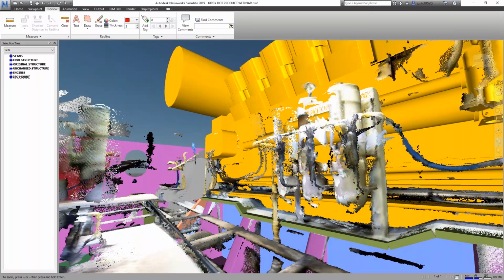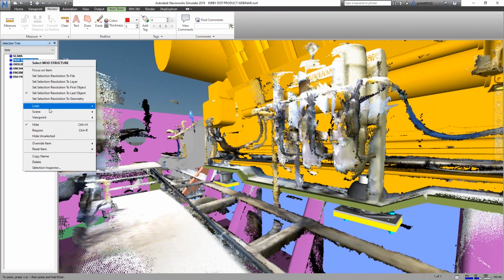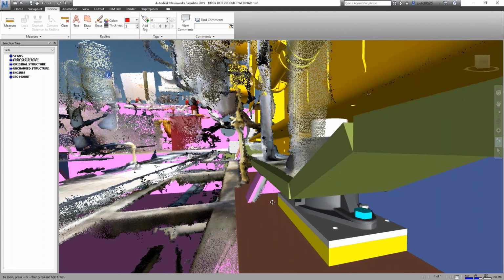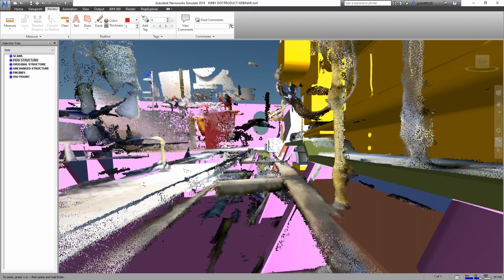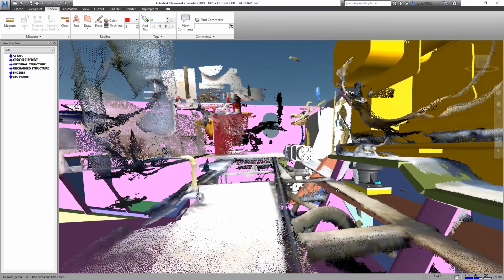So we can see there's a fuel filter assembly here that's mounted on this existing girder. We'll need to address that in the new design. There's also some fuel piping that's going up to it. So if I turn back on our isolation mounts and our proposed modified structure, you can see with this larger faceplate, it now sticks out into the space a little bit. This pipe is going to have an interference. This support structure is going to have to be modified to suit the changes that we need to make on the engine girder.